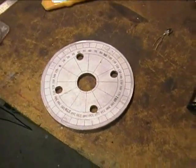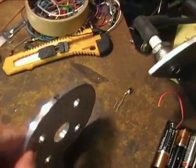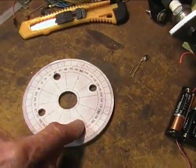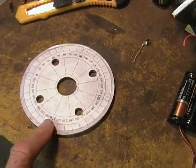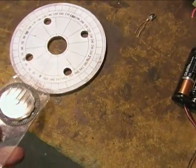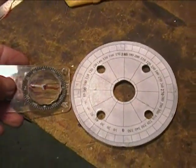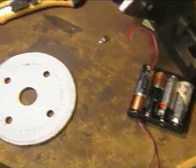I just wanted to demonstrate my new sensor wheel that bolts on to the end of an Onan generator flywheel. It's 3/16ths aluminum with a paper degree wheel that I made with a CAD program. The four holes are indexed to be 45 degrees away from the quarter-turn marks, and under each one of the quarter-turn marks is a magnet. The north side of the zero-degree magnet is up, so the south end of the compass points at it, and the other three are the other way around — for the 90, the 180, and the 270.